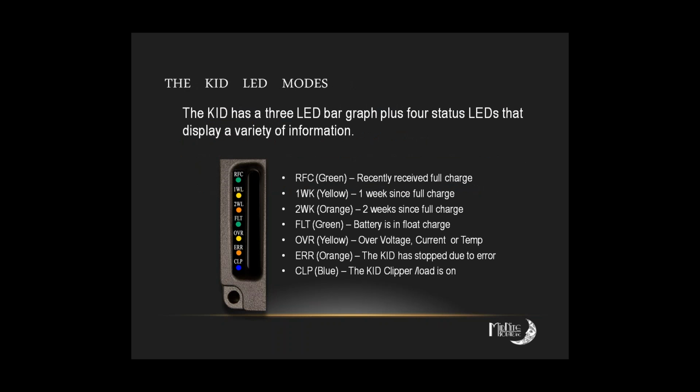You should get something through even on a very cloudy day. I mean, on an extremely cloudy day, you'll probably get open circuit voltage, but if there's not enough current to get above a certain threshold, you're not going to process anything. To the best of my knowledge, you're not going to see anything on the status light screen. You'll see PV input voltage on the display, but you won't see anything on the LED display.